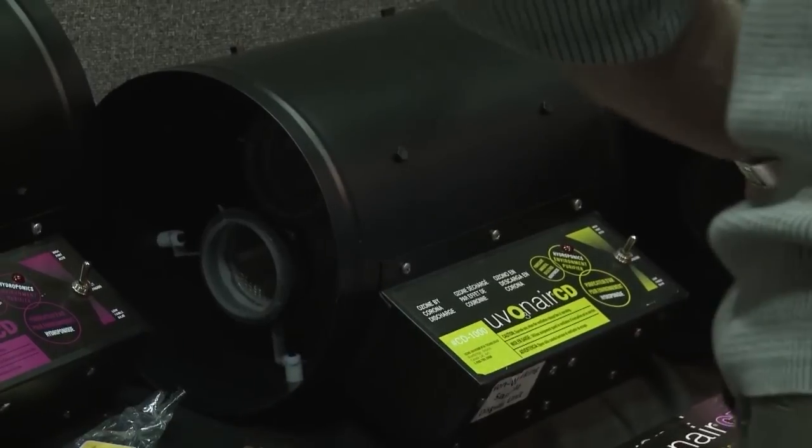The corona discharge is a unit whereby you're passing an electrical charge between a ceramic glass in the center and a metal grid on the inside and the outside of the ceramic. Basically, it's making mini lightning bolts, and a lot of them. These units produce 10 times the ozone that the ultraviolet produce. And where we use them is a myriad of places in this industry, of course, in greenhouses and any hydroponic applications. So how does ozone fit into the hydroponic industry?